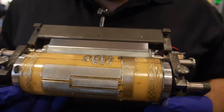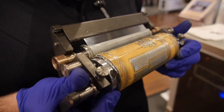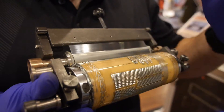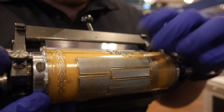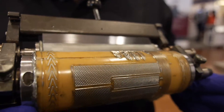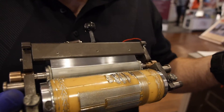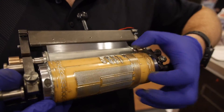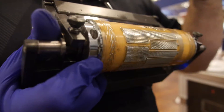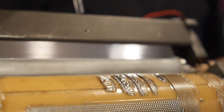So you work with partners to make some of these? Yeah. You can see their logos here. DuPont provided the plate for this particular film. Cal Poly — actually a university — is doing image processing, and Harper made the proofing press right here. The image processing involves converting a digital file into a physical plate by creating a very high pixel-count bitmap, around 4000 dpi.